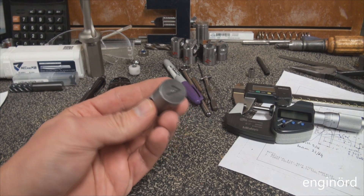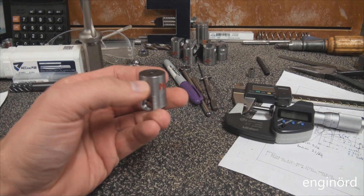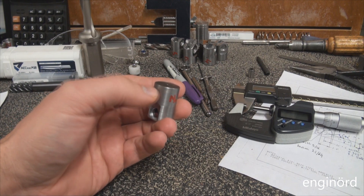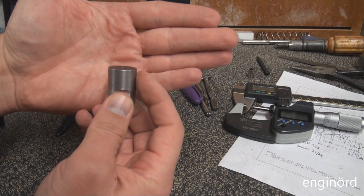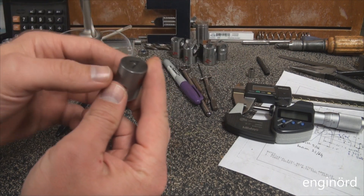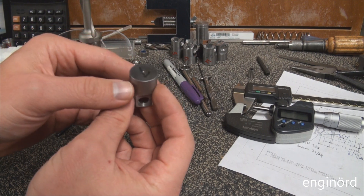But my tool changer is not working. What I'm going to do instead is create a serial operation where I pop this in, create one op, repeat it on a set of parts, then change the tool, change the program and do the next step. The next operation I originally designed to do on a lathe - it was more suiting for a lathe - but then I'd have to do everything manually. Since I have the CNC it can do the job and also hold the tolerances and the size.